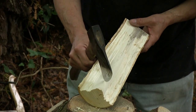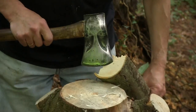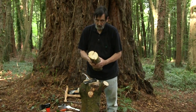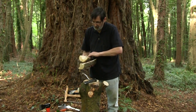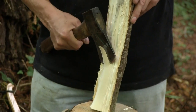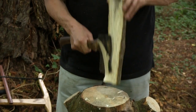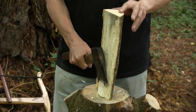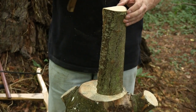You can see how this has a growth ring — we don't really call them annual rings so much. If you remember we had this together, it was wider here and wider here, and you can see this branch coming off. So what we actually have is the main growth of the tree, the main center of the tree, and then this growth coming off at the side. I'm using the axe centered on the wood like this, then going like this — this reduces the risk and lets me use the weight of the log and the axe, and the natural property of the wood to split, to my advantage.